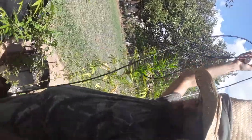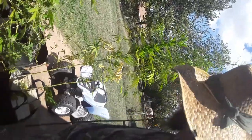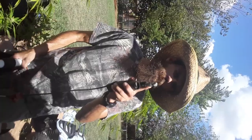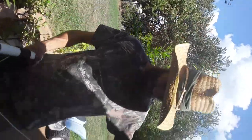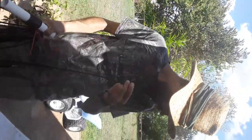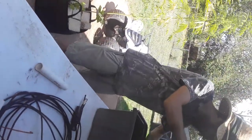And then, like I said, I've attached my feed line to this antenna. So what I've got to do is come down here — this was a 50 foot run, probably 45. I don't know if the SWRs are going to be okay or not. I've attached this antenna to a lot of different feed lines and had good SWRs every other time. So I'm trying this method — you may want to try it as an independent antenna and attach whatever various feed line you like. The only problem I've found is that moisture gets inside those SO239s and it'll kind of throw your SWRs off. What I'm going to do now is attach my PL259 — or SO239, I don't know — to the end of my feed line. And then that'll be that. Since we're here, might as well show you how to do that.